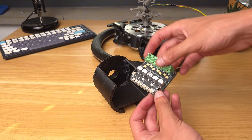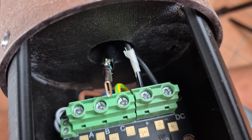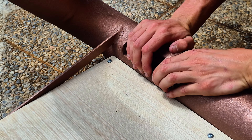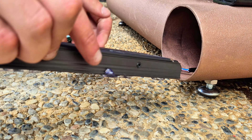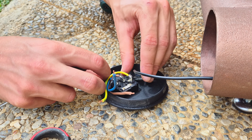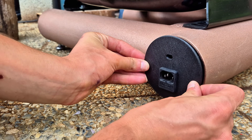The controller and braking resistor can be mounted on a 3D printed component that slots directly behind the wheelbase, with a hole to allow the USB and power cables to pass through. The USB cable goes down to the USB hub, while the power cables go straight to the power supply which gets slotted and fixed with hot glue. The cable from the USB hub connects to a USB-C port which is screwed to the end cap together with the power socket, allowing easy access to the needed ports.